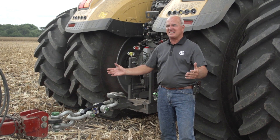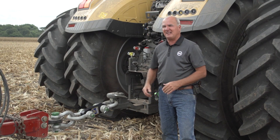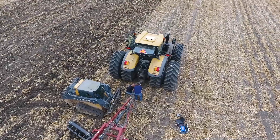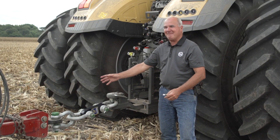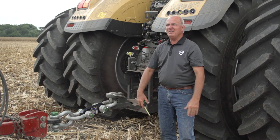We realize that everybody's soil is going to pull different — whether you're from Missouri, Minnesota, or Nebraska, all farms pull different. This is a side-by-side comparison. We're leaving at least 30 inches of virgin ground on each side of the ripper each pass so they pull exactly the same. I've measured to make sure the cylinder is the exact same extension for the front gang disc, and both are set at exactly 11 and a half inches depth. We'll do four passes and average them to get a good read on draft in this corn-on-corn field.